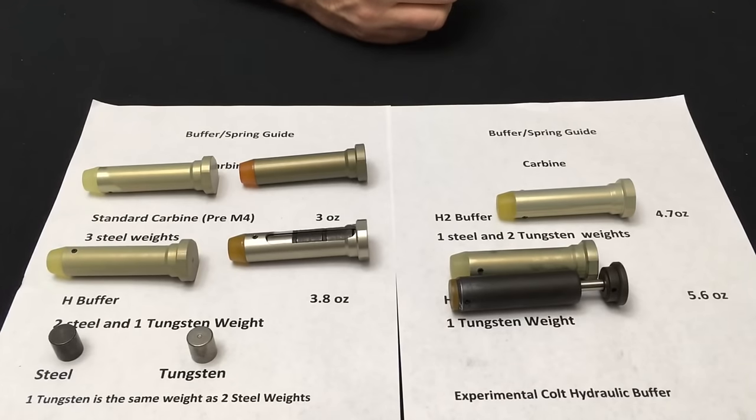The next buffers are for the 9mm carbines and submachine guns — a rather interesting topic. You see a lot of people building 9mm guns swapping around buffers, and I don't think they really understand the consequences. The 5.5-ounce buffer is one of the heaviest offered and is manufactured out of steel. This additional weight is necessary because the 9mm is a blowback operation rather than gas-operated. It's the actual weight of the buffer, the spring, and the bolt carrier that keeps the bolt closed long enough for pressures to drop so the 9mm cartridge case can safely extract.